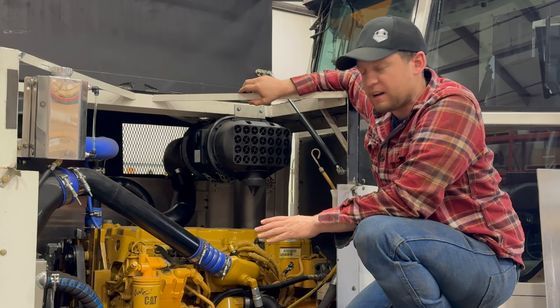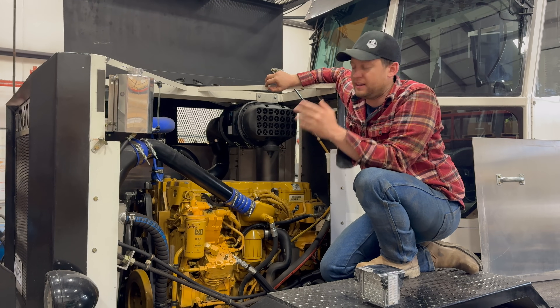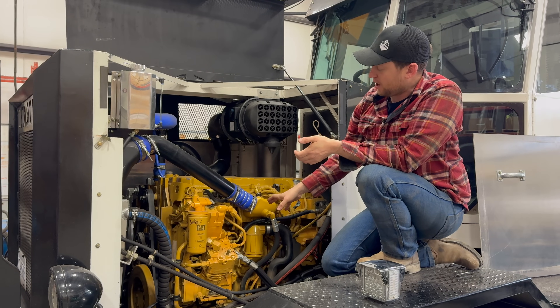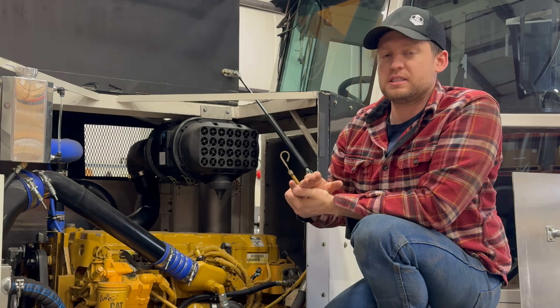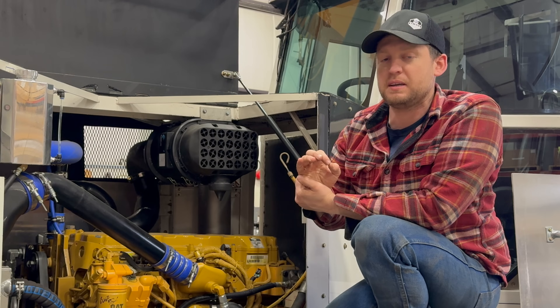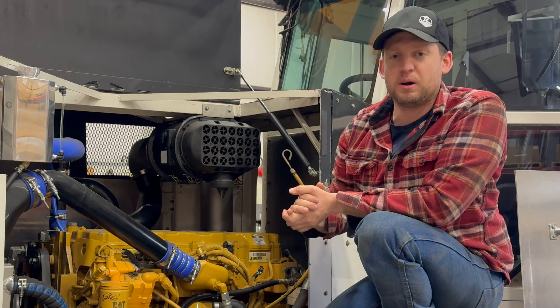Because this is a generator, it runs at one RPM — you get one steady voltage, which sounds great, and this was a mistake we probably should have realized. When the throttle comes on and you're asking for power out of the back end of the generator, the generator actually lugs down a little bit. When it lugs down, the speed decreases just a tiny bit, but that tiny decrease in speed was dropping the voltage level below where the 3-in-1 wanted to see it.